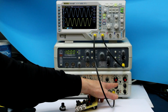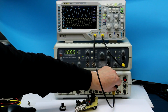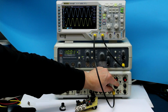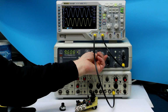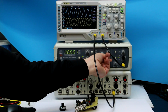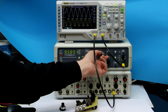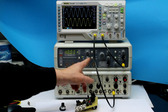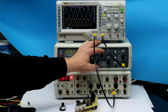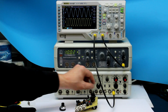What did I do here on my own home build? I have, first of all, a 10-turn potentiometer where you control your frequency really finely. And so I've retrofitted the ELV one here with a 10-turn knob as well, so you have very fine control. You don't need the fine control potentiometer anymore, because the 10-turn pot is so exact in the setting that you can set it to nearly better than 3 decimal places, and more is not necessary simply because you always have the thermal drift.